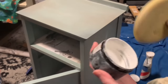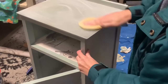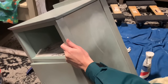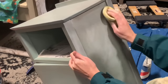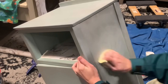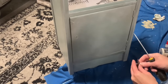The final coat is the actual sealing and also another layer of texture. I'm using white wax to seal the entire piece. I'm not worried about doing multiple coats of poly because I've already done two coats that already had poly in them, so it's mostly sealed, and adding the wax gives it that last layer of protection. This also helps marry all of the colors together and tones everything down so it's not super shiny. All these layers of colors, different textures, satin, matte, and metallic all going together creating just the most amazing finish. You let it sit and then wipe it back once your piece has absorbed as much wax as it's going to absorb.